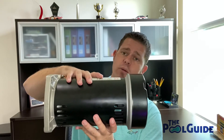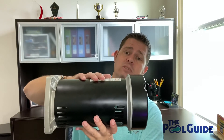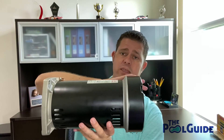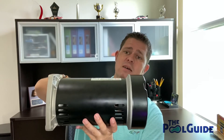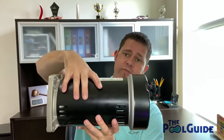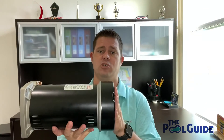If you have a single speed motor you should have a cover over it. There are covers sold for them — I've seen people put five-gallon buckets over them, but don't do that. These motors do require airflow; they will overheat and shut off. They do have a thermal sensor that will protect them, but they need airflow. There are covers designed to go on motors that are open on the front and back, preventing water from falling on it while still allowing airflow through the chamber.